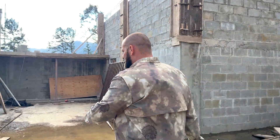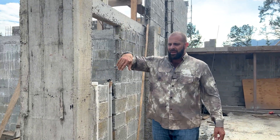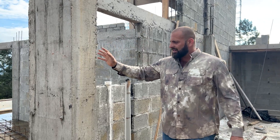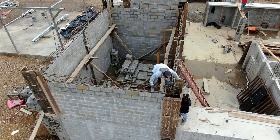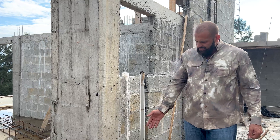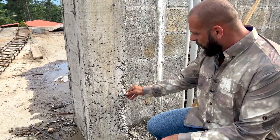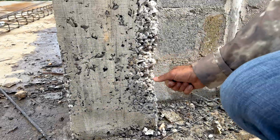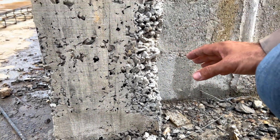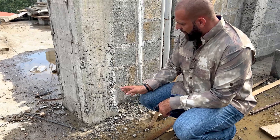I'll come over here and show you an easier area to see the issues we're having. We don't have a sonic vibrator — I just haven't invested in that — and obviously we are having some issues with the columns as you can see. What I'll do is chip out what can come loose. It doesn't look strong but it's actually quite strong — under maybe half an inch once you get rid of the rock on the outside, the rest is quite strong. I'm going to break all that out, clean it very well, paint the epoxy, and it'll be 100% fixable.